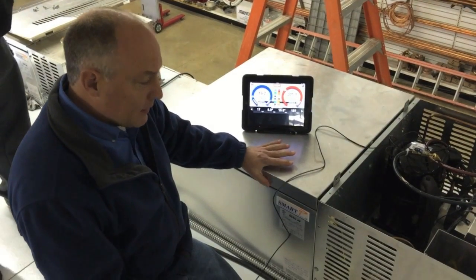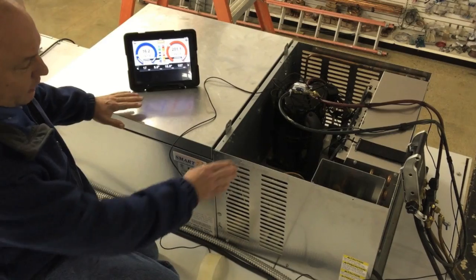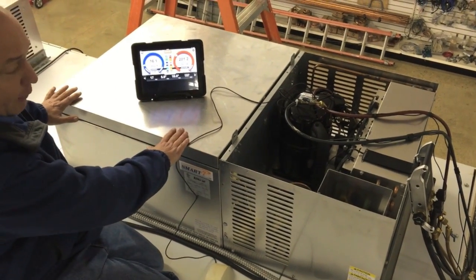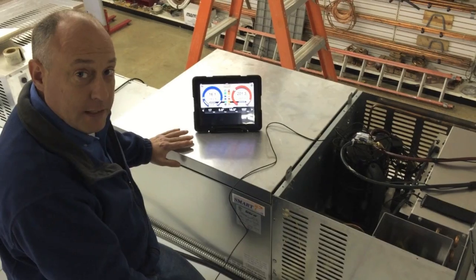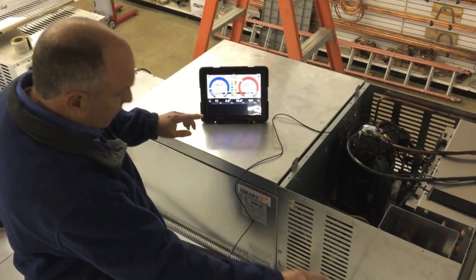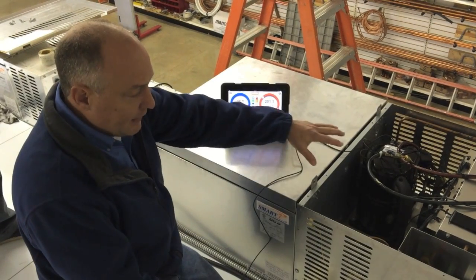What we have right here is a top-out package unit — it simply is evaporator and condenser. You've got the condenser unit over here, evaporator section over here. The evaporator is set over a hole in the cabinet and just has supply blowing out this way and return coming back up the other side. Evaporator fans are right in the top, condenser is here.